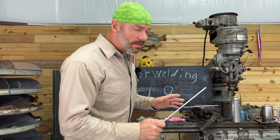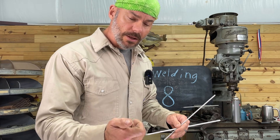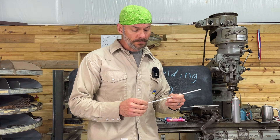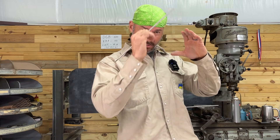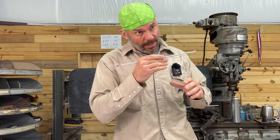You want to be right there. On a 3/32, the tip of your rod will be glowing when you're done welding — just remember that, that's a little tip. Not so much with the 1/8, because you can't really get them that hot. If your tip's glowing with a 1/8 and you're going uphill, there's a good chance you're running a little too hot — it's going to be puking all over the place. If you don't hang out over here and you just try to go up the middle of it, it'll try to come out at you. It wants to eat. Staying on the edges and not right dead in the center will probably help you.